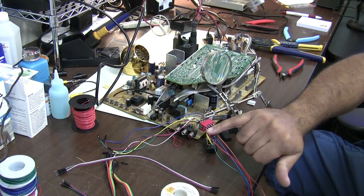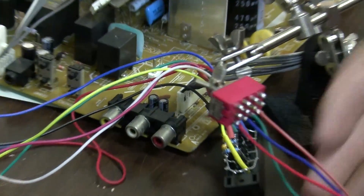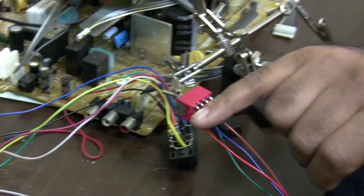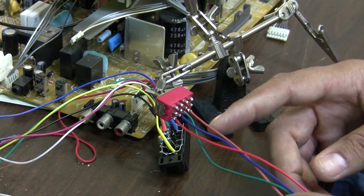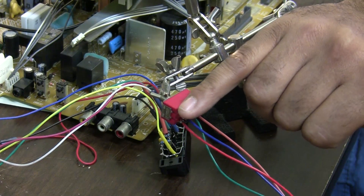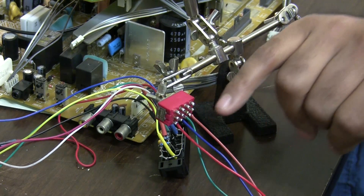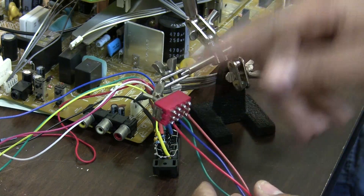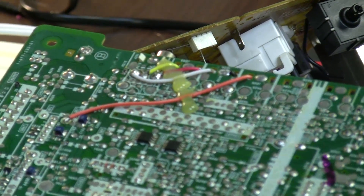The middle is your common point, and that's what goes out into the RGB sync lines — basically what goes into the jungle chip. Your 4PDT switch connects to the middle. Right here you have the five volt blanking — I grabbed it right by the regulator. Also right here is where you tap in for audio. To get audio going through, you're just feeding off the regular inputs. So you've got your left audio, right audio, and your sync — all tapping into a normal input.